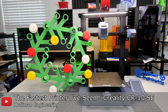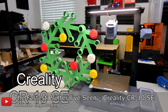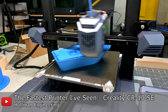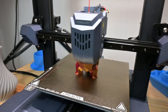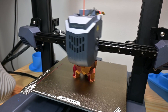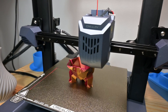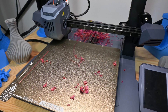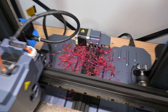For the prints, I figured fast and hot would be the worst case scenario, so I used the Creality CR-10 SE and printed at around 300 millimeters per second at 220 degrees Celsius. I printed my test models — a Benchy, a Segmented Octopus, and a Low Poly Squirtle. They all printed well, except for the octopus using FixDry's Tri-Color Silk PLA. I tried three separate times but I could not get the small segments to stick to the bed — they would separate and I came back to a pile of spaghetti each time.